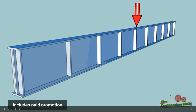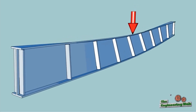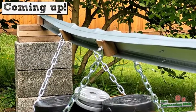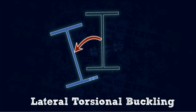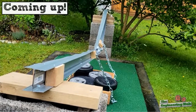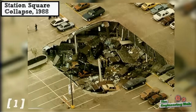What you see in this video is an I-beam that usually gives great strength in one direction, but once it starts to get a little bit twisted, the design of the beam starts to fail structurally because it's no longer being supported by the design and engineering of what an I-beam or a racking column is designed to do.